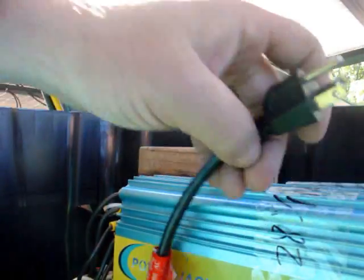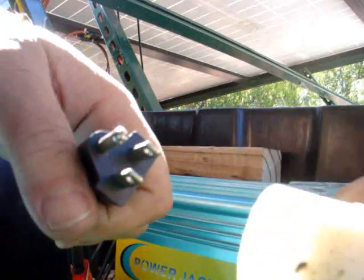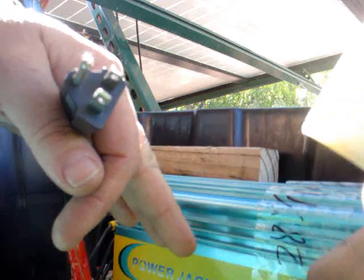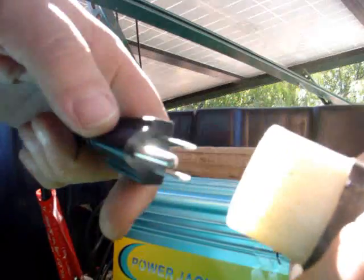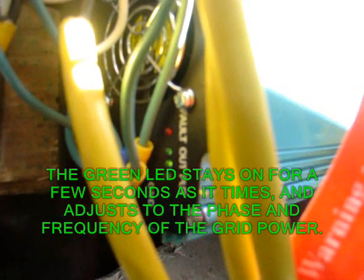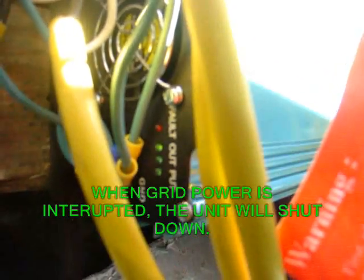The on/off switch is on these, but the electrical is not hooked up — the electrician hasn't come by yet and I'm not licensed to do that, so I won't. But I do have a heavy-duty extension cord here, so I'm going to go ahead and do the test. Before you hook this up, first thing you've got to do is make sure the switch is off — turn the unit off, hook your solar panels up first to the grid-tie inverter, ground it, then make sure the switch is off, then hook it to power. Turn the switch on — you notice one LED stays on for just a second and then it starts going. This unit is operational: the green lights blinking in order and not the red light means everything is a go.